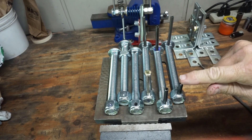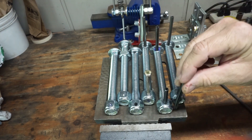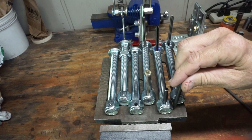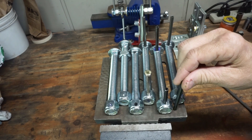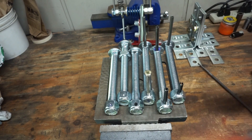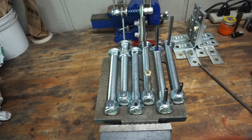As far as what size roll pins to use: a two-inch roll pin is just fine, a two-and-a-half inch is a little bigger. I would recommend going with a three-inch roll pin on the front — it gives you just a little more room. On the back I'd recommend using a three-and-a-half inch roll pin. When you get to tightening things you're going to want a handle to grab when doing your adjustment, and the longer pin makes a real nice handle to hold onto as you're applying tension with your tensioning nut.